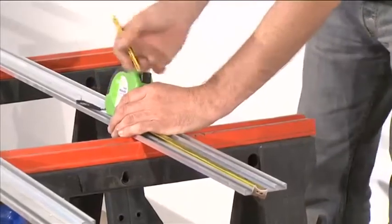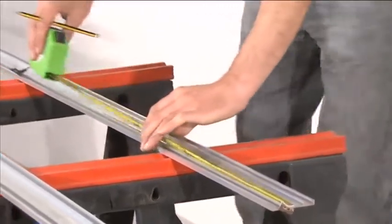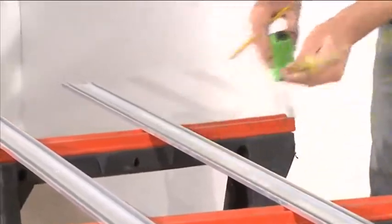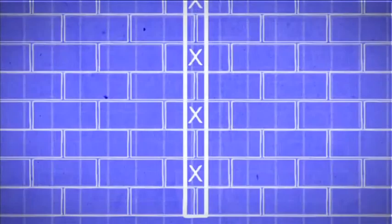The first and last 60 mm fixing bolt should be positioned 50 mm from the top and bottom faces of the wall connector, with the rest being spaced equally between. A total of 3 fixing bolts are used per wall connector on a dwarf wall model and 5 per connector on a full height model. If any of the positions marked for the 60 mm fixing bolts land on mortar joints, adjust the position accordingly so that they locate over solid brick.